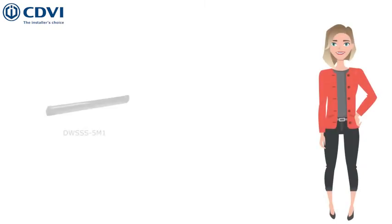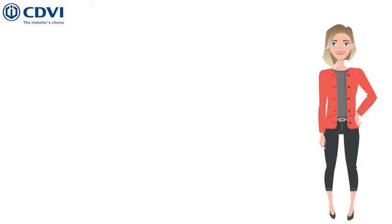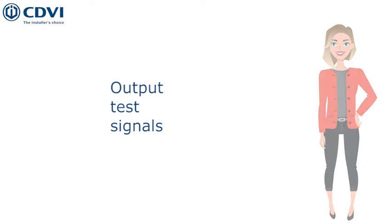All photocell safety sensors will need to be monitored by the drive system to comply with the standard. Both DigiWay operators are equipped with output test signals that check the photocell's status before any motion. If the test signal changes regularly, the door motion is enabled.